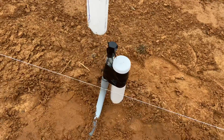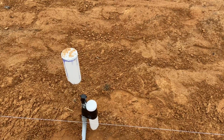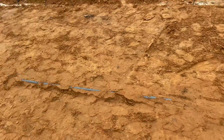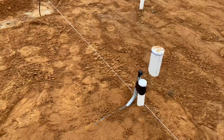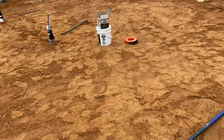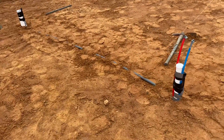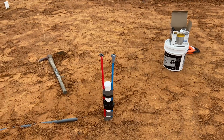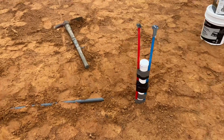That's the plumbing vent for the master bath that's already in the wall. I'll just tie that conduit right there and it will eventually tie into an electrical box with an outlet and into the rest of the system. Pretty easy — conduit, two 90s, that's it — with a pull string so I can fish wires later. An alternative would be to use UF cable, but I prefer conduit and I already had some THHN wire, so I went that way. It's actually cheaper — UF cable is really expensive.